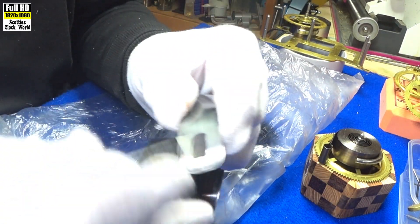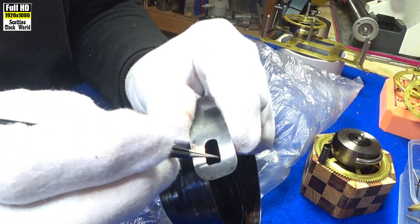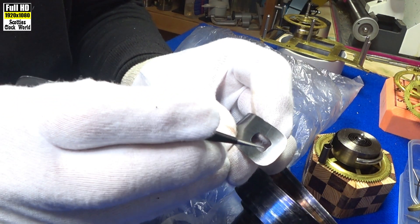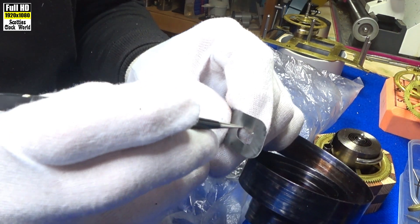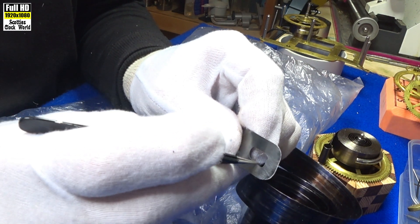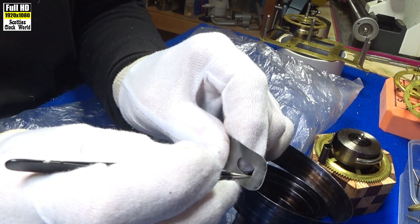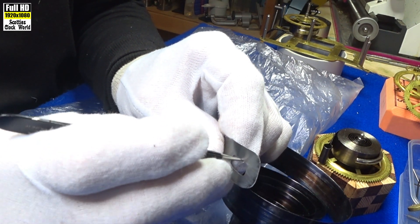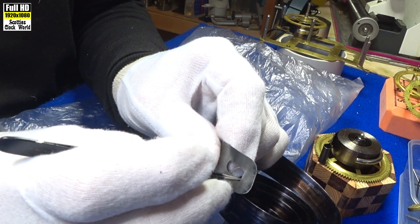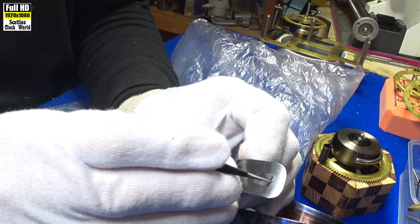That's more the general shape of what a hole-end mainspring hole should look like. It should be narrower at the top, then down, and then round. You don't want square corners because they're stress multipliers. You use a fine clock file to square the ends off and a round rat-tail file. When you're filing, you don't just push straight — you draw it sideways. That realigns the molecular structure of it. The same applies around the curves with your rat-tail file, then it'll be nice and smooth.